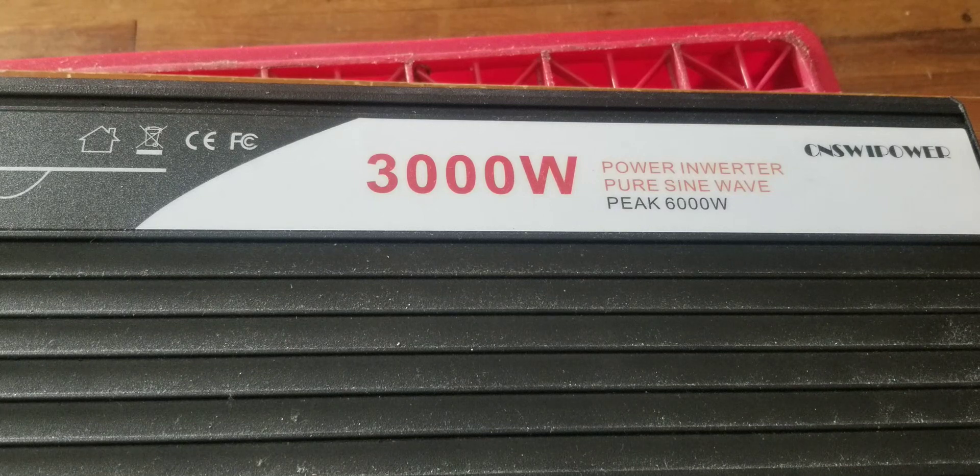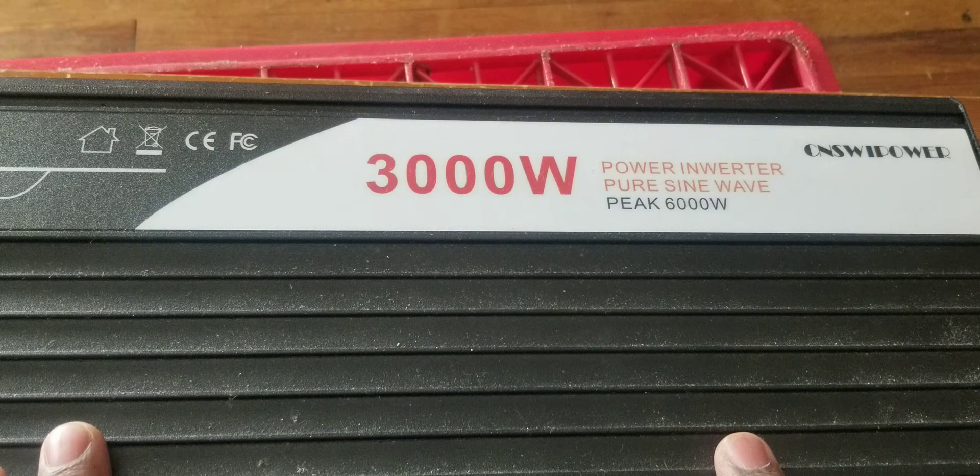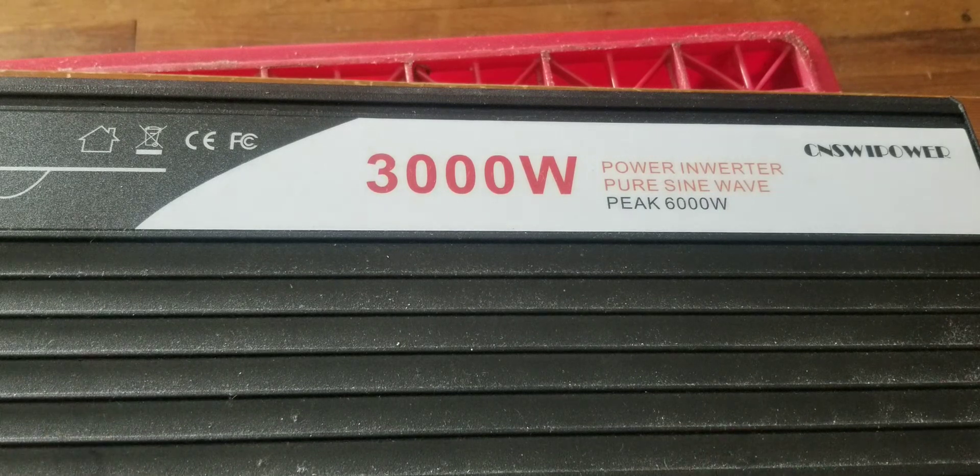I'm going to try to do this for you guys — please subscribe because I'll be back with an update. The inverter was working fine and then stopped working. I took it apart and there's nothing wrong with the MOSFETs, nothing wrong with the fuses. I was watching a video where somebody mentioned that when you overload it you may have a problem and need to short-circuit it to reset. I'm not going to short-circuit it before I talk to the manufacturer, because I drained it already — there's no power on it and the capacitor has no charge.